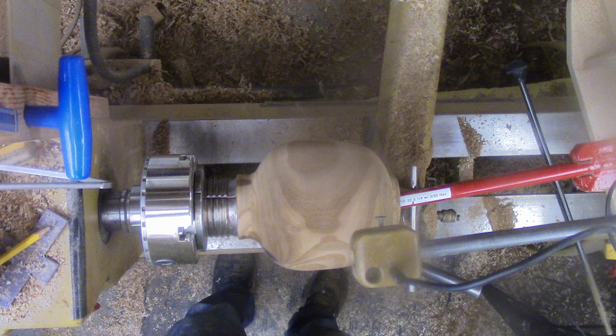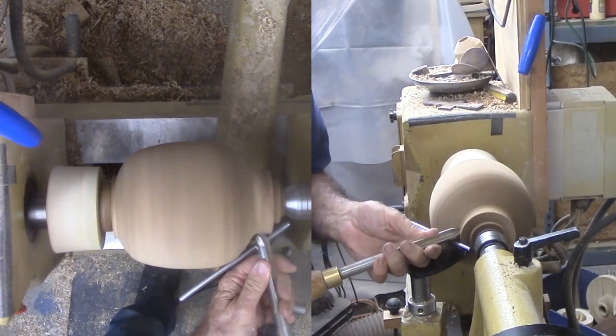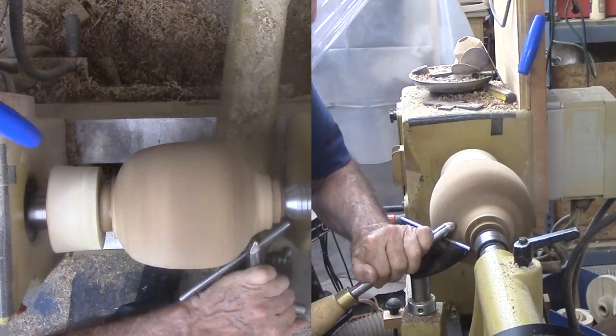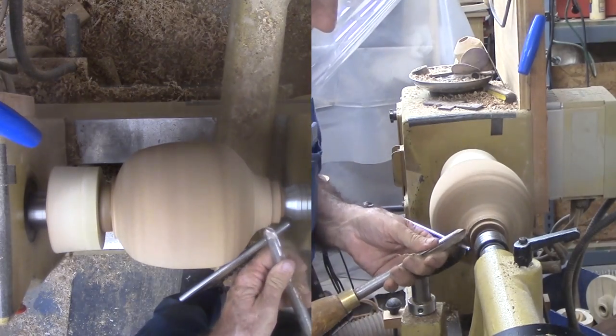This time the wood is hard. Meanwhile, my vase has holes in both ends — nothing like any vase I have ever seen. I prepared a tapered plug from another piece of Russian olive, mounted on a faceplate and glued it in place. After the glue dried overnight, I can do the final trimming, particularly at the neck. A lot of shear cutting since I do not want to remove very much wood — only some trimming mainly at the corners where I know there is enough wood.